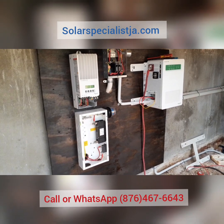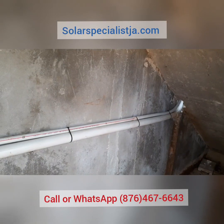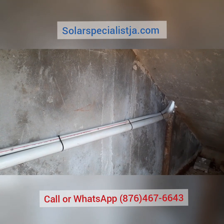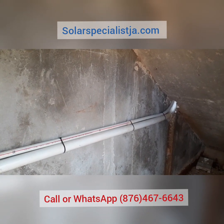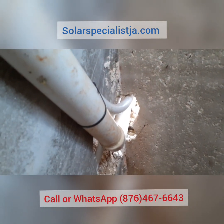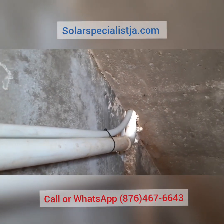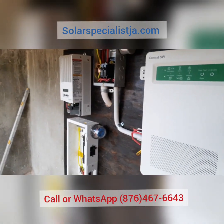Here's a sneak peek as we continue to work. Here are the pipes that were mentioned in part one — there was no PVC cement in the couplings, it wasn't strapped on the wall or anything like that, so everything was loose. We're also going to fix this hole right here, because water will come down and travel along the pipes and possibly end up on the equipment. We're going to add some cement right there to just patch that little hole. Here is our system still under construction right now.